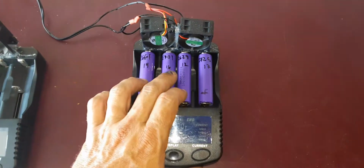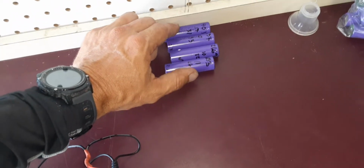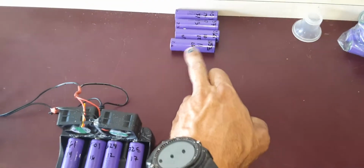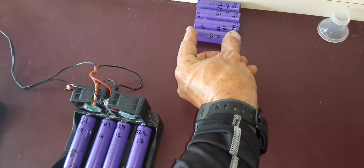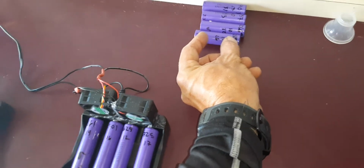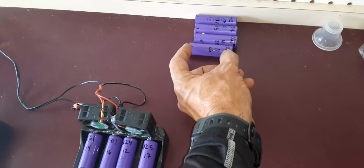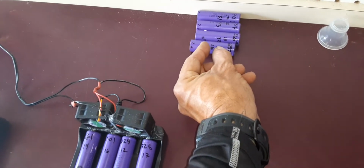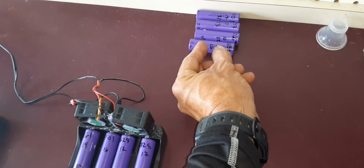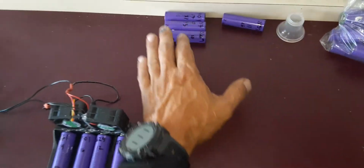As you can see, the resistance values are fairly close, which tells you it's a good battery. If it was a bad battery, you'd be looking at like 150 resistance, which means that the dendrites, which are inside the cell, as you charge and discharge, depending on how violent you charge all the way and then discharge as low as you can get it, start building up, and once they connect inside of the cell, they'll short it out. Or if they're really close already, you'll have a really high resistance, which will mean that cell is bad and you shouldn't be using it in a battery pack where you're gonna have, like 84 different batteries.